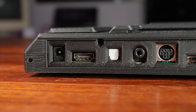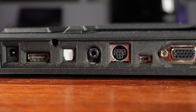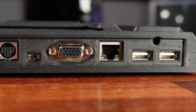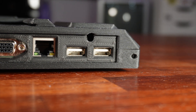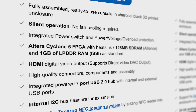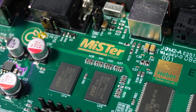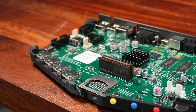Round to the back of this analogue version, you get the power jack, an HDMI connector, a Toslink digital audio connector, analog stereo audio, RGB output via a DIN connector, a 15-pin VGA connector for connecting to a PC monitor, RJ45 Ethernet, and two more USB ports. If you opt for the digital-only version, then you'll only get an HDMI connector on the back — none of the other audio, video, or networking ports that are in the analogue version. That said, it's the same 10-layer PCB no matter which version you go for. The digital version just saves on the cost of the premium connectors that Heber have used, and those savings are passed on to you.